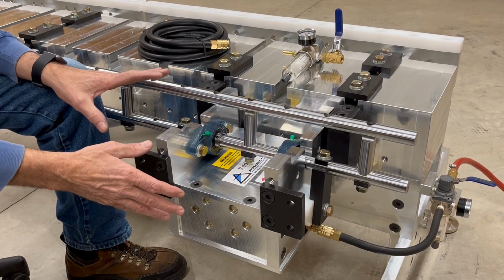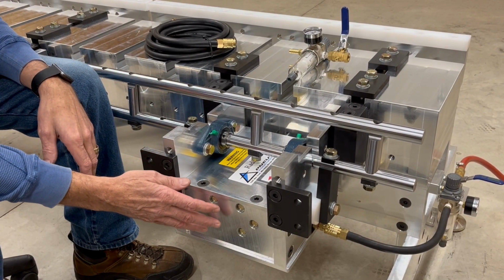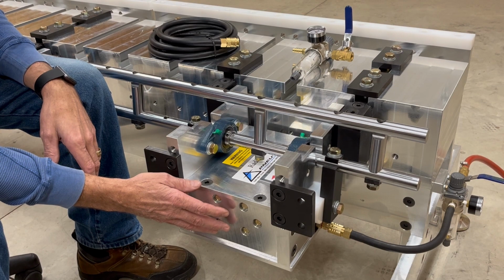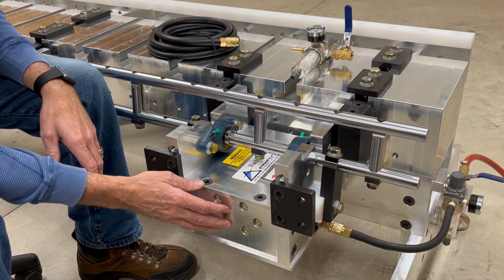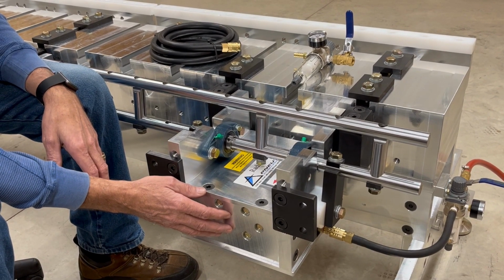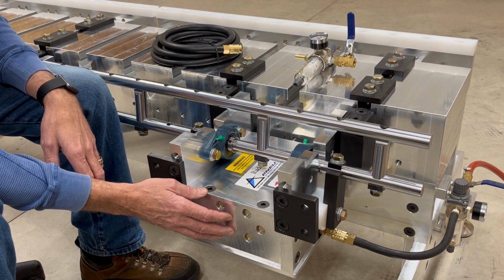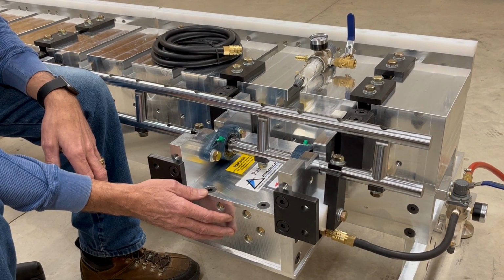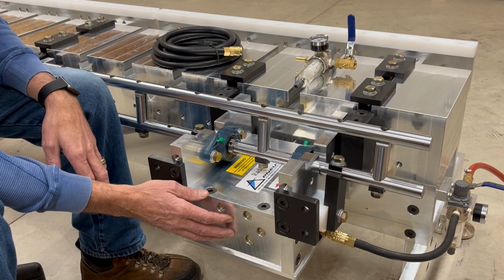All right, another important feature of this shaker system is the fact that this pneumatic or air-powered shaker drive is sealless. And because of the fact that it's sealless, it does not require any inline air lubrication. Also, this is a very efficient, low air consumer. The shaker drive only consumes slightly more than 1/2 cubic foot per minute of air. And based on today's cost for producing compressed air, this shaker drive only costs pennies per hour to operate.